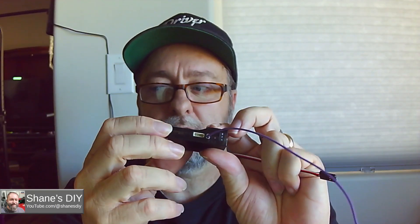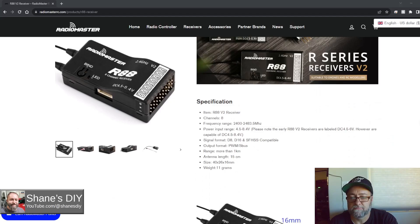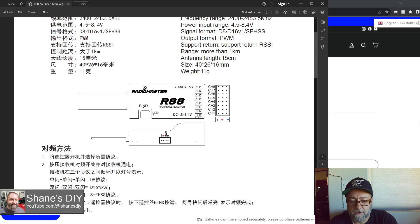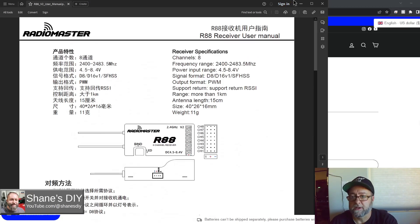The bummer is they don't give you a connector for that. The connector they include doesn't have a wire in the fourth position at all, so you can't get a signal out of that easily. I cracked the thing open and injected a voltage carefully to the inside pin. Going through the manual, there's nothing in there about voltage or pack voltage information — no indicator for what that pin is. But I did verify that it works. Once I got that voltage in there, it was not scaled correctly, so later in the video I'll show you how I corrected that scaling.